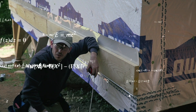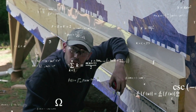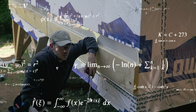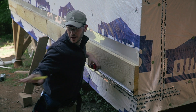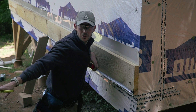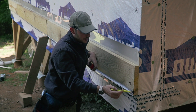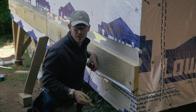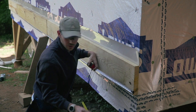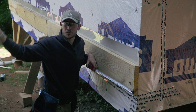8 plus 16 is 24. Because of the location of my post on this outer beam, I'm actually having to place the first one at 8 inches and then everything 16 inches on center after that. It'll make much more sense when I build the front of the cabin.